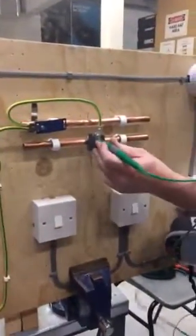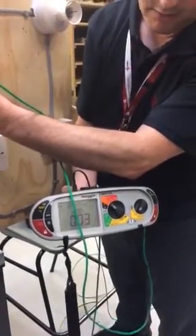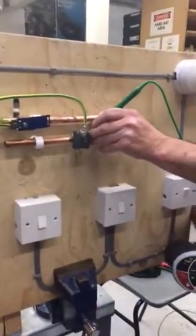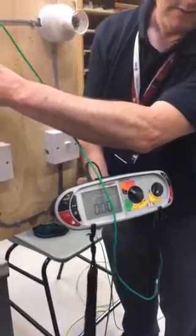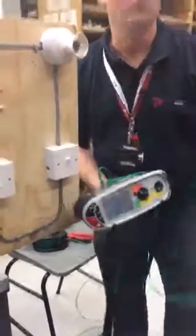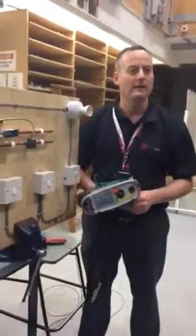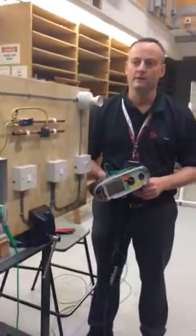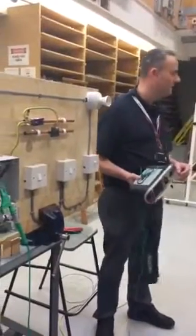So we go to the second pipe. We check the front of the clamp and we get a reading of 0.03, but we're more concerned about the reading at the back than actually onto the pipe itself. Again our reading is zero. Of all the readings we get, we record the highest one — in this case 0.03, which is under the maximum reading of 0.05. Therefore the protective bonding conductor complies and can be left in the installation.